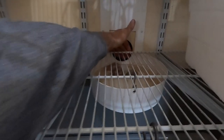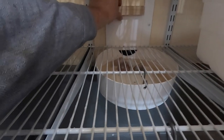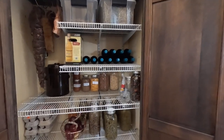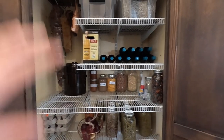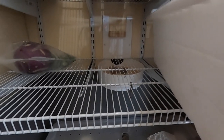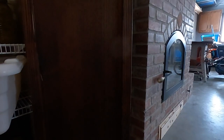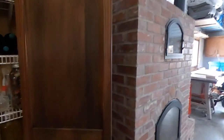I can feel the air just pumping in right now. Depending on how cold it is outside, I can adjust this vent to allow more or less cool air and airflow in. Having it right next to this stove in winter is important because otherwise this building would freeze. When it's minus 40 Celsius outside I have to shut it right down. It lets me play around with temperature and humidity since we live in a really dry climate.